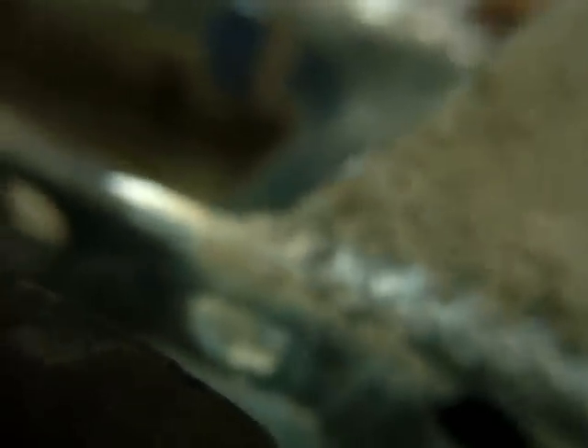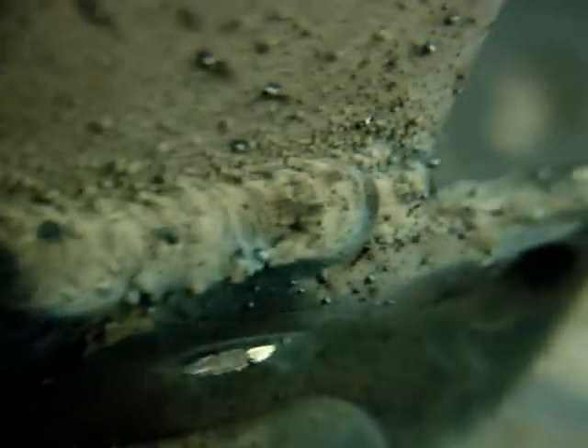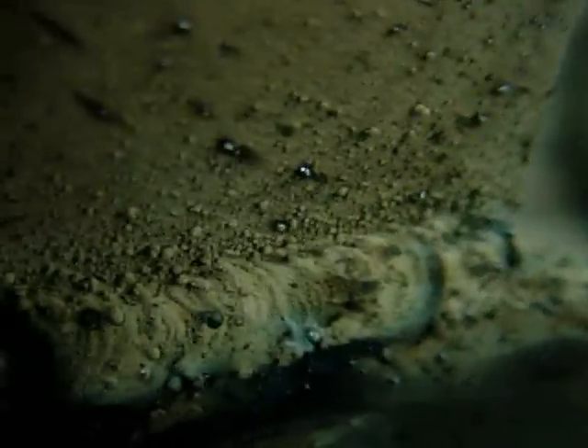There's the other, the last welds. Didn't take long to get used to that wire welder. A little different angle here — I think I did all right. Flip this thing around, and there's the other weld. Good welder makes a lot of difference — having enough amps. I hadn't even hit this yet to clean it up. And there's the last weld. I'd say that's pretty doggone stout. I beat the crap out of that — chipping all that slag off. Then I hit the bar a couple times real hard. She's melted in good. Those metals are joined all the way down to the crack. I filled the crack first as I welded, and the rest of my pattern just joined the sides.